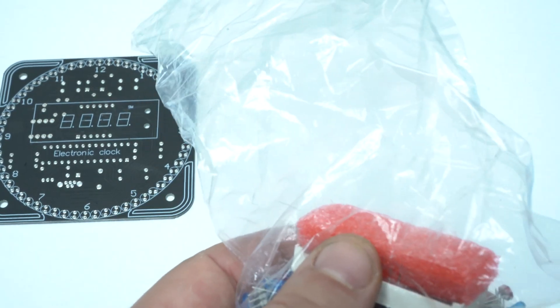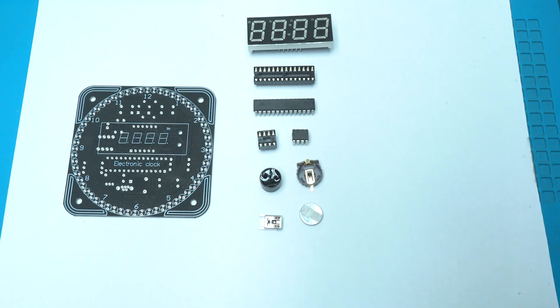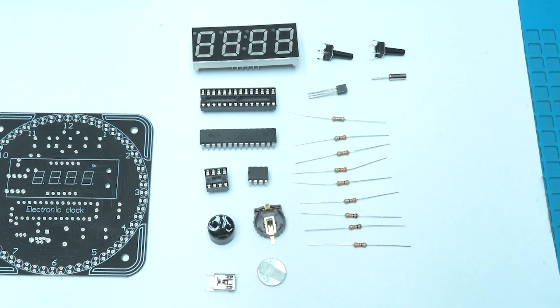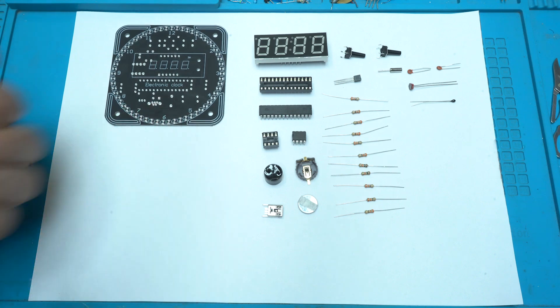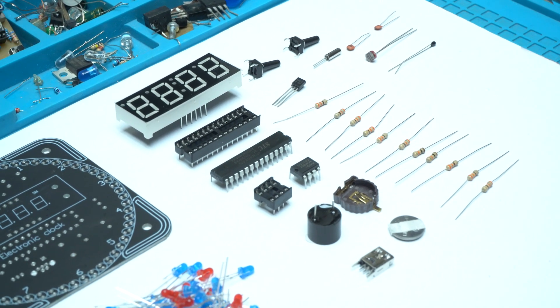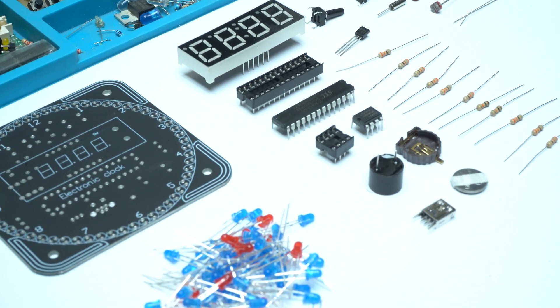The clock can remember the time when power is off. Besides the quality PCB board, the most important components for making this clock are the single-chip microcontroller STC15W408AC with a 28-pin holder, and the DS1302 timekeeping chip that needs to be powered by an external lithium battery and 32 kHz crystal oscillator.